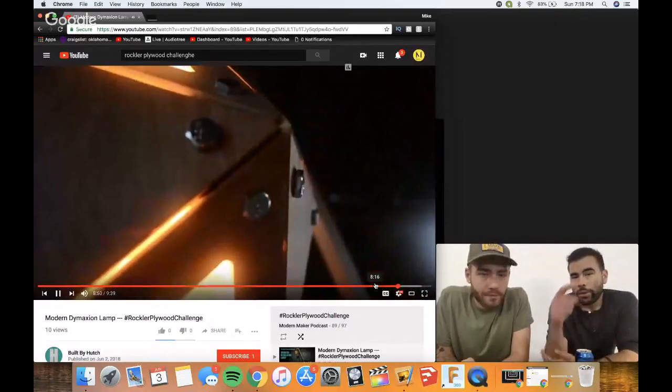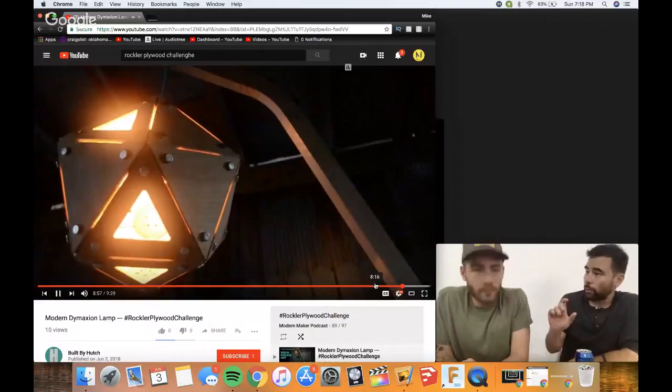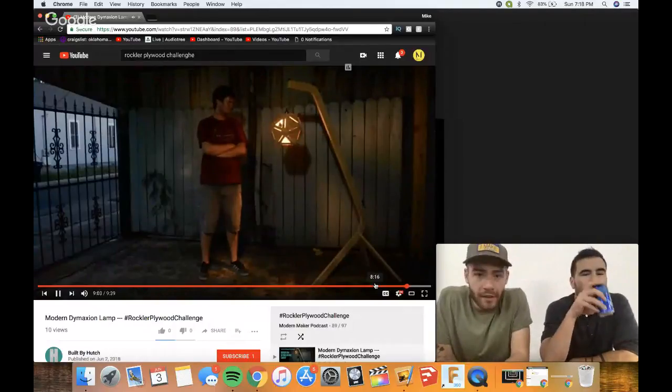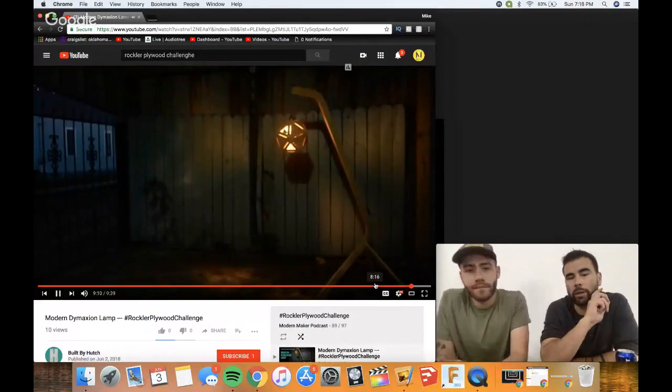I do too. So one thing you can do with those hex bolts is you can take the angle grinder with the flat disc and grind them down so they're a little bit thinner, so they don't quite protrude as much, and you can take off those numbers too. Yeah, that's really nice. Have that over your chair that you can read at. Or whatever. Awesome. So that was the modern Dymaxion lamp.